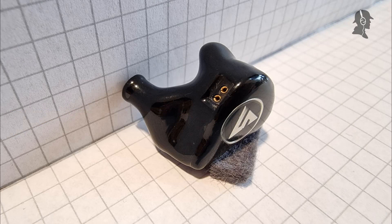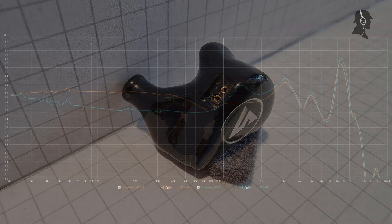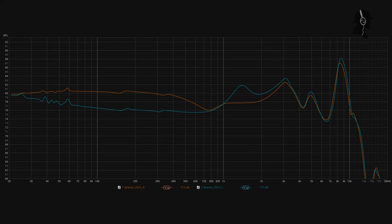The first unit looked totally fine — not dirty, just like any other IEM. But the replacement unit I received, and I kid you not, these are the measurements — this is not the same IEM. There is no similarity going on here. What the hell is going on with MEOS and HiFi Boy? This is the worst channel balance I have seen in forever. It's not even just a peak issue or dampening for one of the BAs being off. The second unit is completely different — both are called OSV3, but there are no similarities besides general peaks at around 3kHz, 4.5 to 5kHz, and 9kHz.